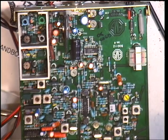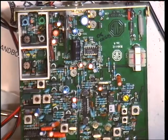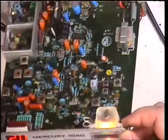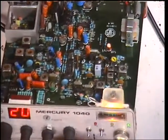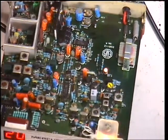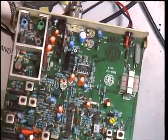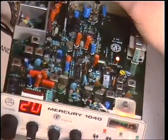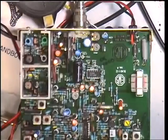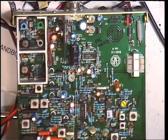Now we need to go looking at the transmit meter. The transmit meter is RV1, which is there. If we're going to transmit — because we know the radio is doing 3 watts — it's going to be supposedly the middle of the scale, as they would say. And we will do that, and there we have it. It's not a calibrated meter, just some kind of guide.